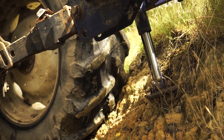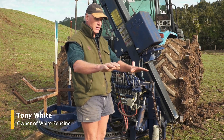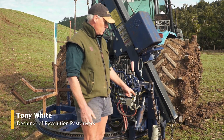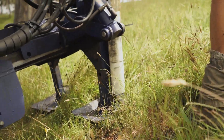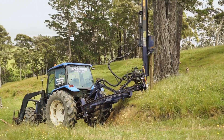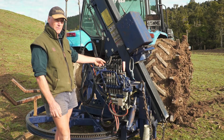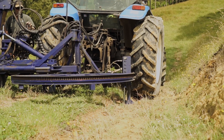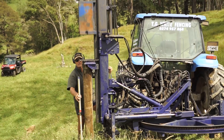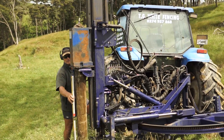This is telescopic. It adds stability when you've reached out into an uneven piece of ground. You put that foot up or down and it allows stability directly under your mast. The base itself has a hydraulic foot at the front operator's tyre side that allows pitch of the base, so we can make the base fit uneven ground.